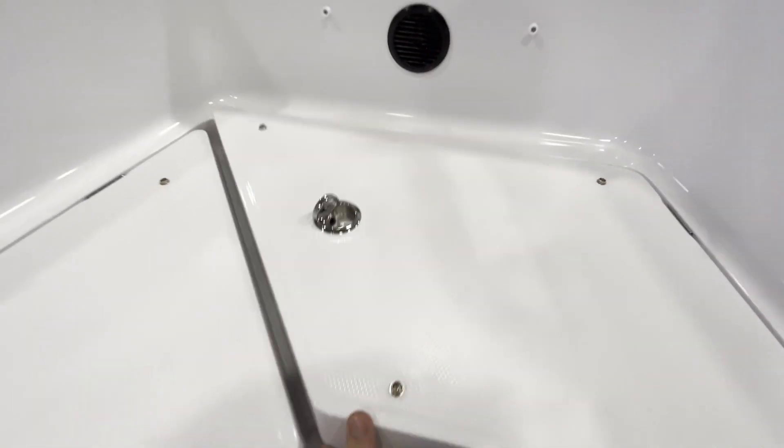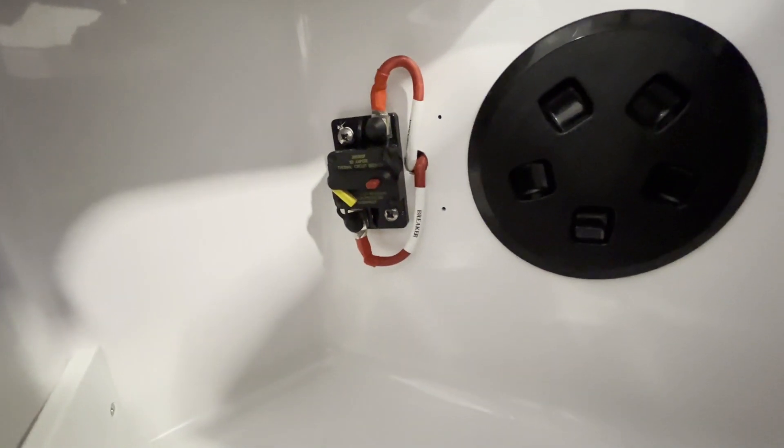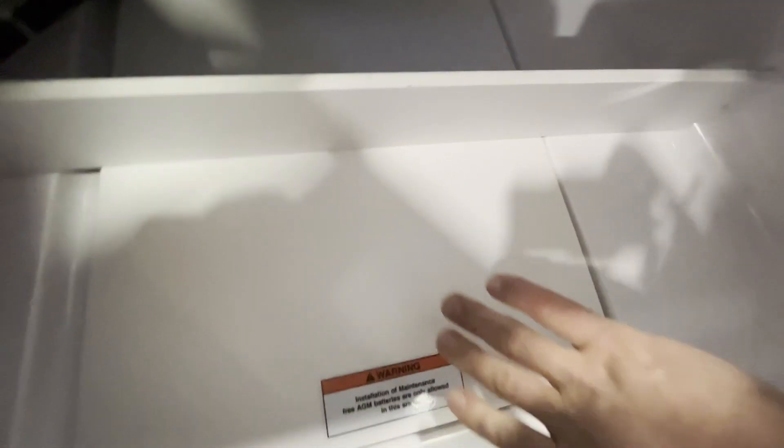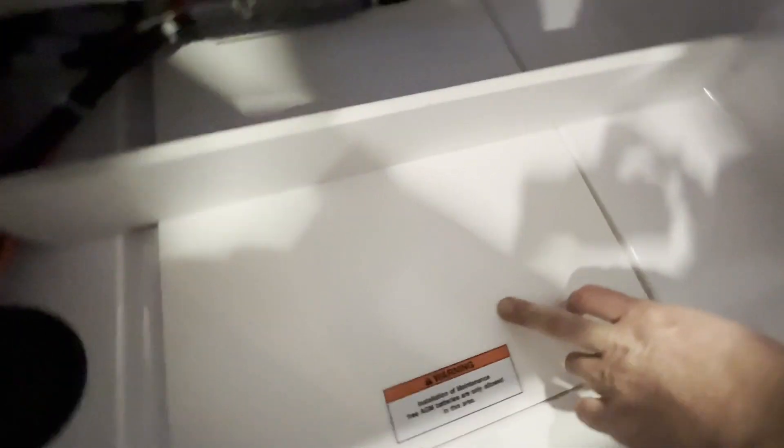Just after that, this locker gives you access to your AC panel, your bow thruster battery switch, and your 60-amp windlass breaker. Inside this compartment is your bow thruster and windlass battery.